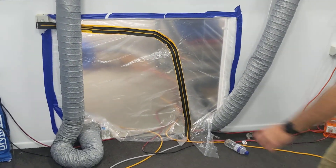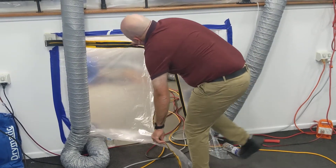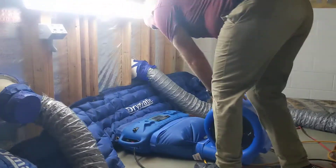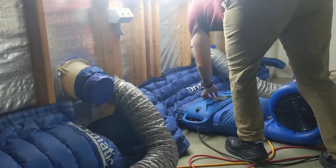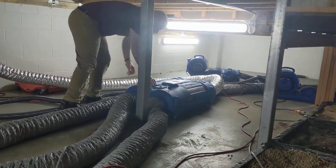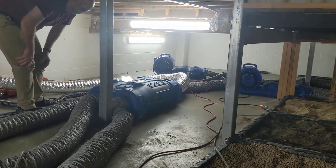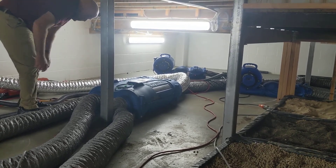Last but not least — it's under the house. We've got our little re-use zips here — one of our Velcro re-use zips. I've got 40 to 45 degrees going into that wall. 45 degrees, 26% relative humidity. Wow — it's starting to dry. I'm getting happy.